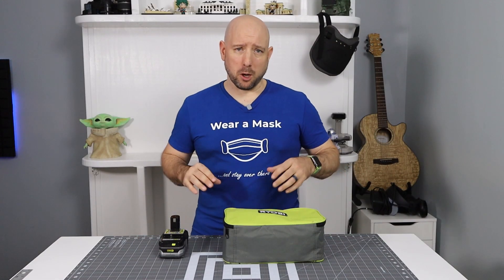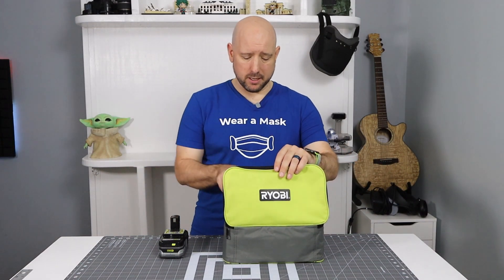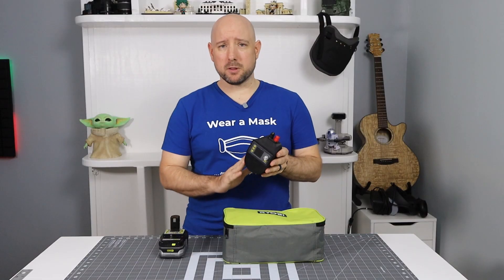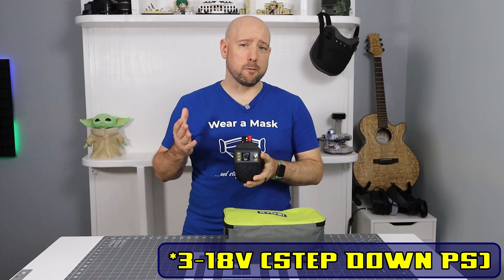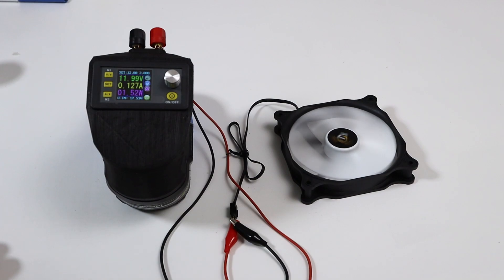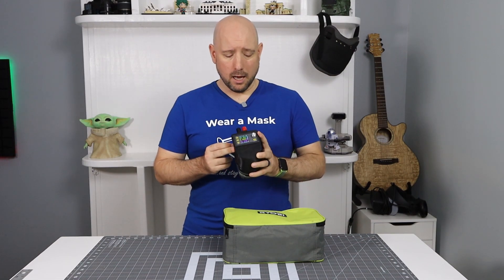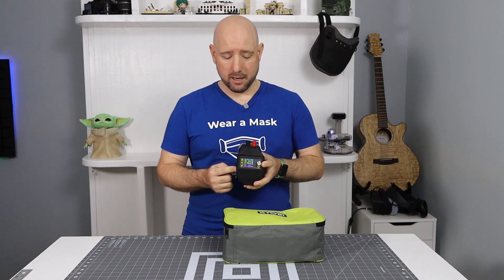So we've discussed four unusually awesome Ryobi tools for makers, one bonus tool, and I also promised a tool you can make yourself — this is a One Plus-based bench power supply. You 3D print this shell, add some electronics, snap it onto a battery, and now you have a power supply that can provide anywhere from 3 to 24 volts. It's great for testing 12-volt NeoPixels, 3-volt Wemoses, 5-volt Arduinos — you can hook anything from 3 to 24 volts and power it off your One Plus battery. To make this, you'll need a 3D printer for the shell, a voltage controller, some tabbing wire for the battery tabs on the inside, and some banana plugs. Links to all of that are in the description below.